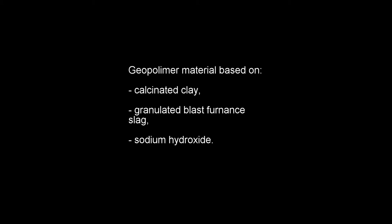Hello! In this video, we will present you the methodology of creation of geopolymer material based on clay and granulated blast furnace slag activated with a solution of sodium hydroxide.